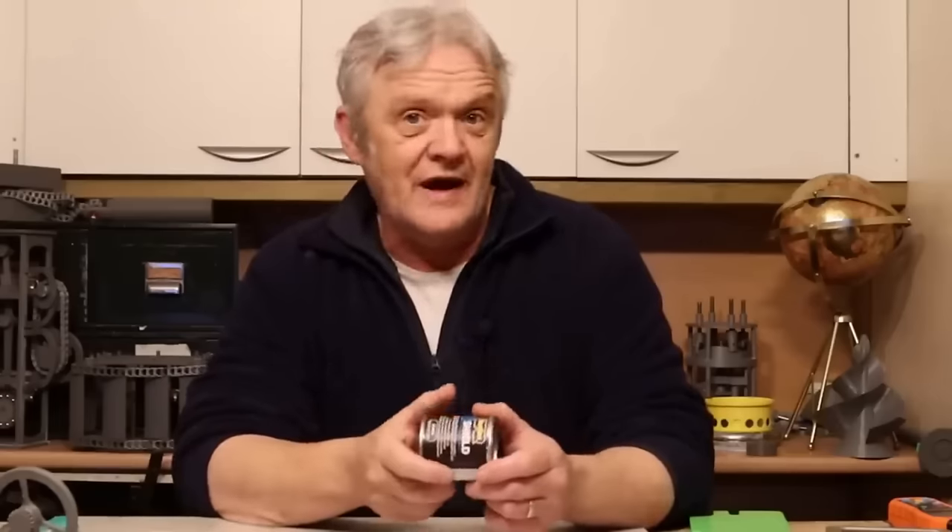It's only going to work temporarily because the binders will burn away, so after a few uses you'll have to repaint it. But we're only going to make a temporary kiln and we're going to paint it onto a plant pot. If you were to mix graphite with something like water glass, you would have a permanent paint that would act as a susceptor.